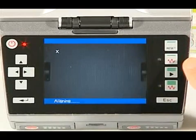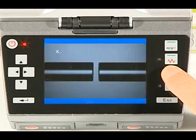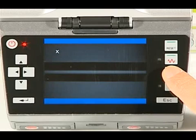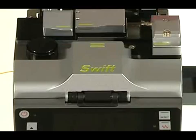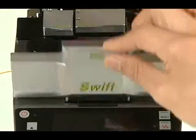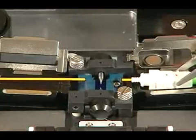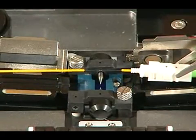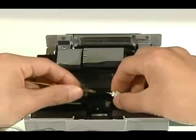After discharge cleaning and arrangement, the cutting angle is indicated. Press the switch and carry out the coupling splicing. When coupling is completed, the estimated loss is indicated. Open the cover and carry out the tension test. Open the fiber holder lids on both sides. Carefully remove the fusion ferrule, grasping the left fiber. After accomplishing this, coupling is completed.